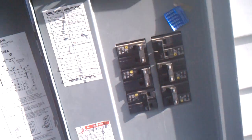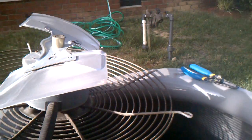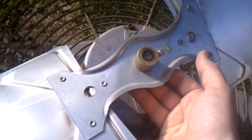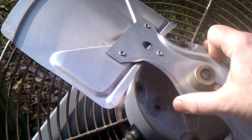So I figured it out. First thing to do is turn your circuit breakers off for the outside unit. Then you take the condenser fan motor off — just the screws down here. It pops out and you can flip it upside down. The first thing you want to look for is bad bearings in the motor — it'll lift up just a couple of millimeters or so, but any side to side movement is bad.